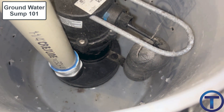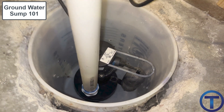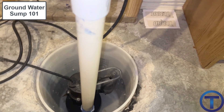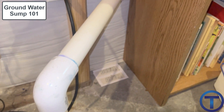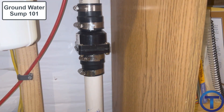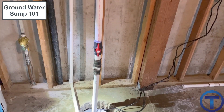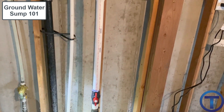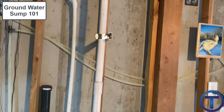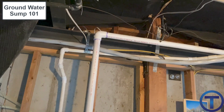We use piping to convey the water from inside the building to outside. It's important that the piping is big enough to handle the pump's volume. A simple rule of thumb: the pipe should be at least as large in diameter as the outlet from the pump. So if it's an inch-and-a-quarter threaded connection on the pump, run inch-and-a-quarter pipe. Also consider that friction and a series of elbows changing directions will create additional flow restriction.